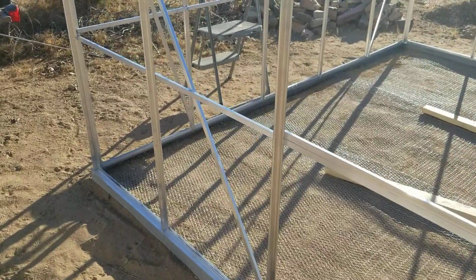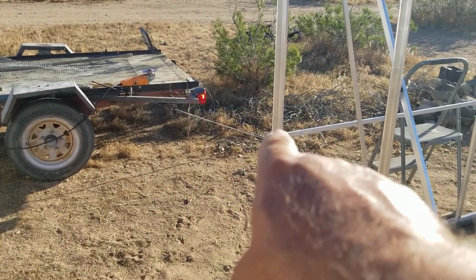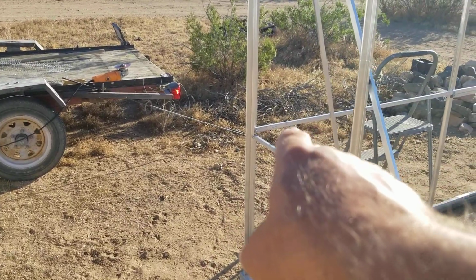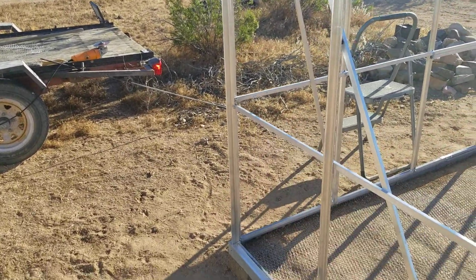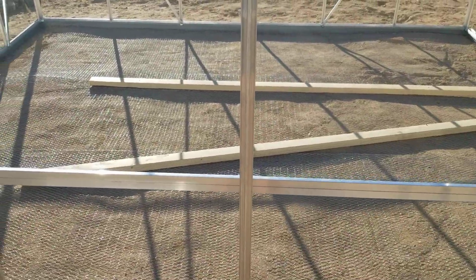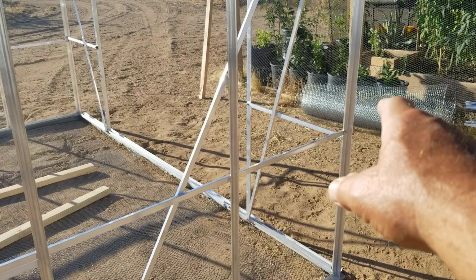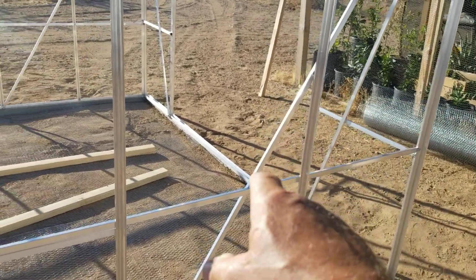Now, when you're putting these things in, you start in the corners. Put the bolt in the corner of the strut or the brace, and then you can raise it up and work your way towards the center as you're going. Then go to the other side and do the same thing. Bolt the corner in, and then come back across and raise it up and get it together.